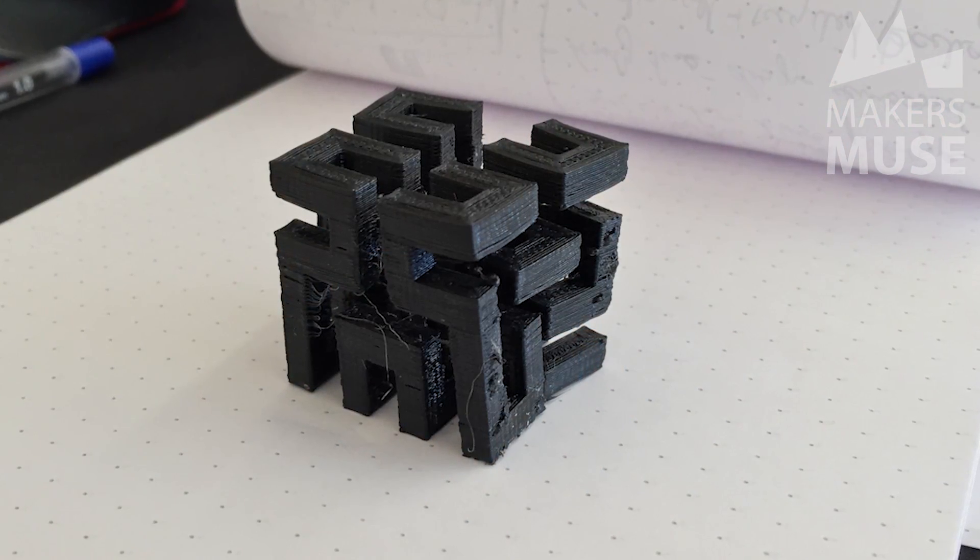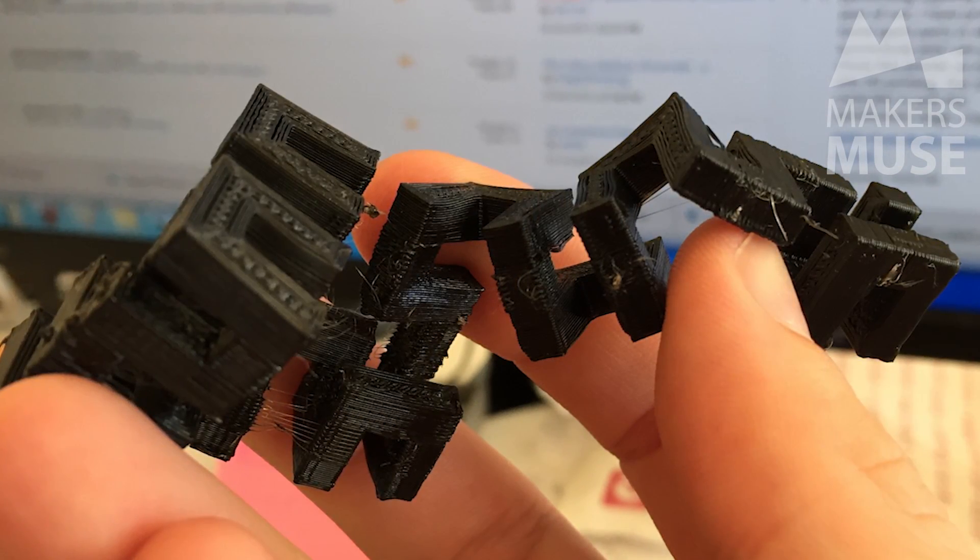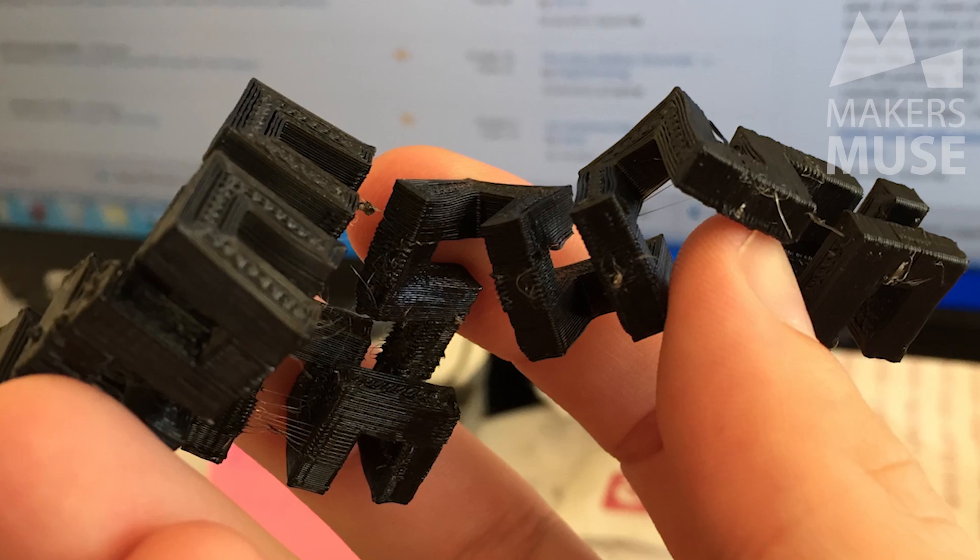TPU is quite unknown at the moment in terms of 3D printing — not many people print with it, which is a bit of a shame because I've been doing a lot of experiments with it. It's quite easy to print with; you don't get the best quality, there's a little bit of stringing, but it's nowhere near as bad as something like Polyflex or NinjaFlex. TPU isn't elastic as such, it's just flexible, which is really nice because it's still pretty strong. Think flex couplers or shock mounts — things that need to be pretty tough — I would go with TPU for that.